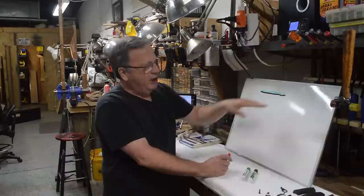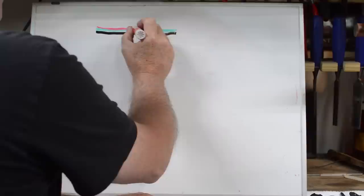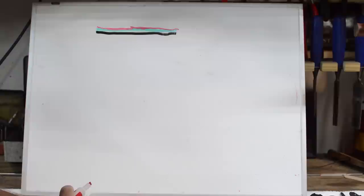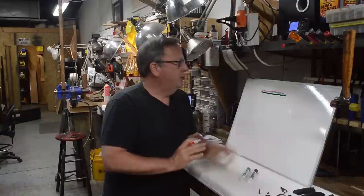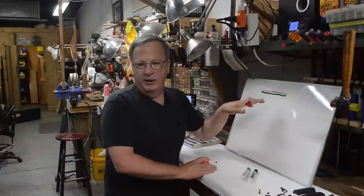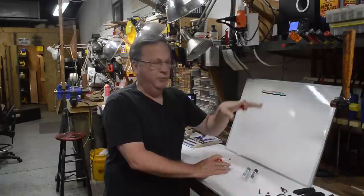Now, once you apply these chemicals to the steel, you let them rust under controlled conditions for a specific amount of time. After that period of time, you're going to get a reddish brown, fine frog hair layer of rust on top. Sometimes it's so fine that you can't see it by looking straight on. You've got to turn it at an angle to a light and then you can see it. It looks like it's been dusted with cinnamon, and that's what you want. Once that's done, that rust is then treated with either boiling distilled water or steam to do the chemical conversion. It'll convert that microscopic layer of rust into magnetite, or rust blue. And that's what we want.